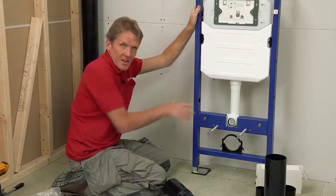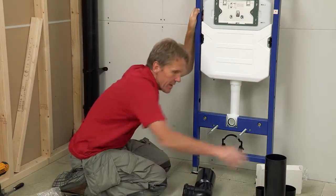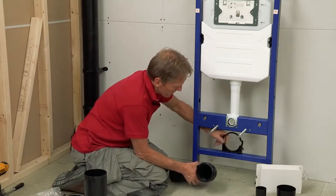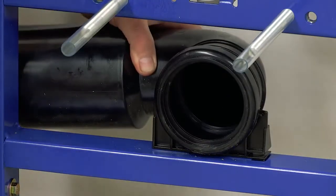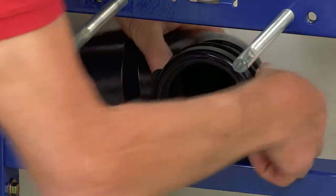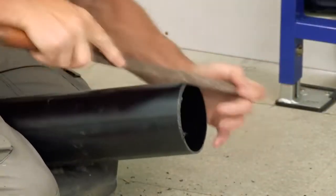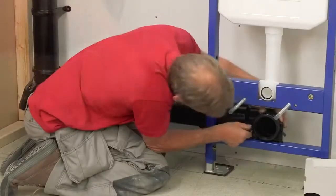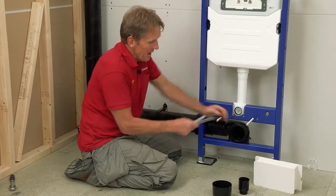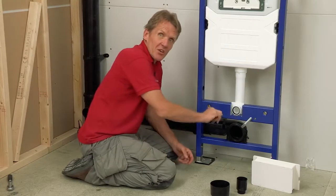That's pretty solid — I'm really pleased with that. Now I can carry on with the first fix, get the carcassing finished. I've got the choice of connectors in the kit — these can cost quite a bit if you have to buy them separately. I'm going to use the bent connector on this one. That's the wastewater out — to me that's always the hardest part because it can only ever go downhill. We'll pop these caps on to protect the threads while we do the tiling. The bolts can be adjusted in or out afterwards to suit the pan.